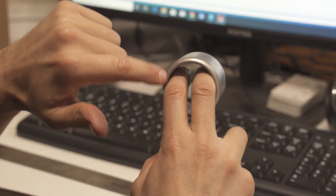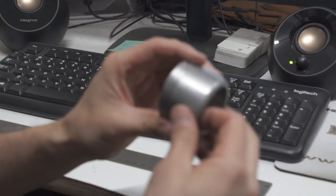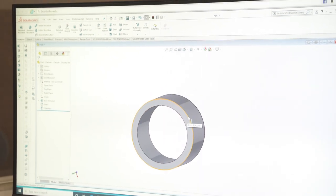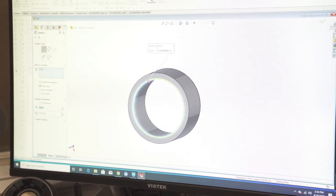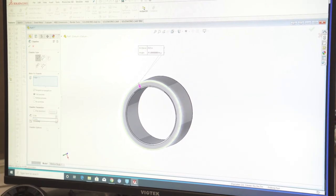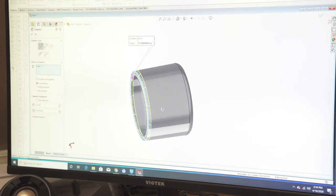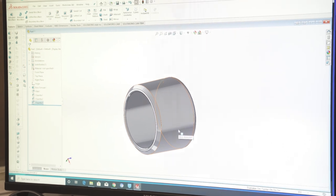The tubing is going to get welded in from the back — we're not going to weld it right here — so we want a nice crisp looking seam, and that chamfer will help prevent the powder coating from doing something weird. Now we're going to spin the part around and do two chamfers on the back. We'll do the inside one first at 0.030 — that one's done automatically. Then we change the outside one to 0.100 — a hundred-thousandths chamfer — so that the back of this piece of tubing has a place for the weld to go.